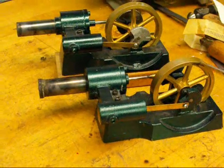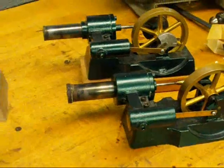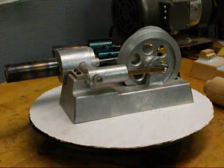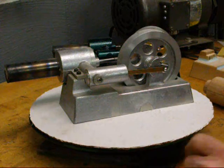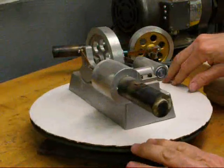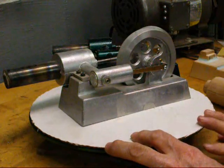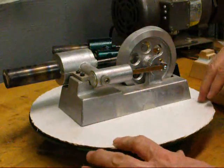This is the one that we talked about in one other video, and will not be discussed now. The other ones are slightly larger, and this will be the topic of the discussion today. The two engines that I'm showing you here now are really pretty much the same, although one is air-cooled and one is water-cooled. This is the air-cooled engine. It's similar to the other ones that I've showed you, and by air-cooled, I mean that the air passes over it and the heat is dissipated in that manner, and some of it's conducted down into the aluminum base and dissipated.